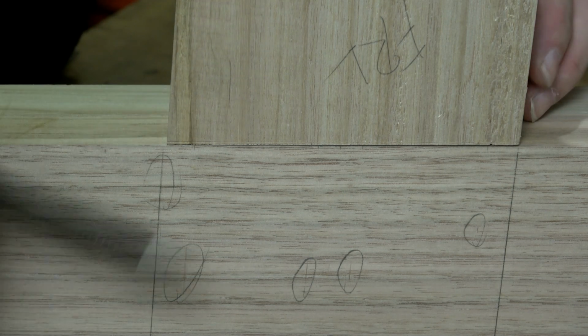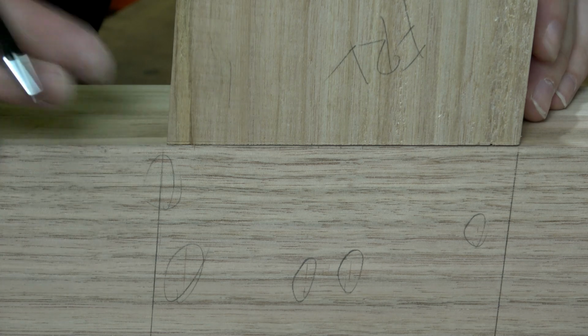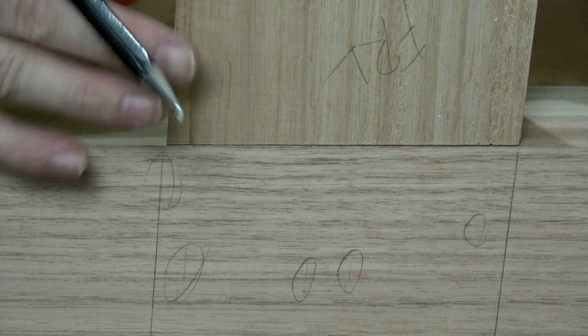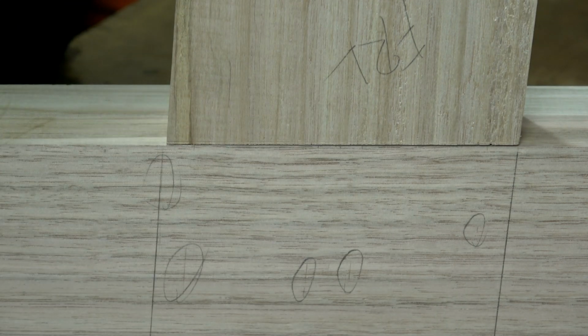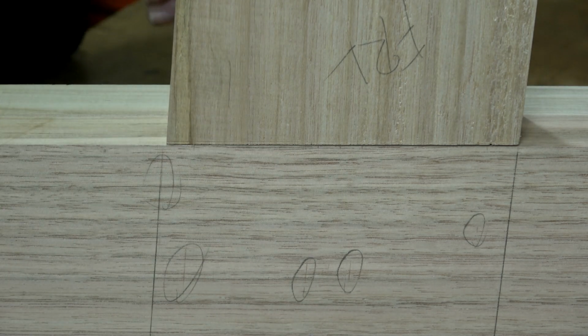So that's really good. It's gone straight in there, nice and easy, nice and tight, and these lines here line up with my edges there, so it's located properly. So now I know that it's very, very close to where it actually needs to be, which will be close enough. So now I just have to chisel away those shoulders there to seat the shoulder down properly.